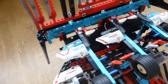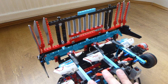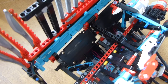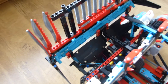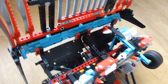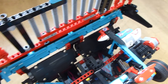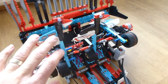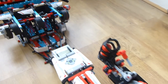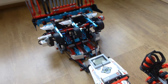A large proportion of the design is the frame at the back, which is primarily to stop the balls, and includes a sort of ball shoot down the back. The balls, when they drop down the back, come into this ball corral at the front. I've had to take quite a bit of effort to make sure balls don't get trapped, because one of the game modes has nine balls, which requires the user to reload partway through, and if they're trapped you're trying to fight around behind the ducks to get the balls.